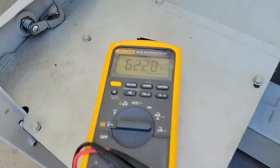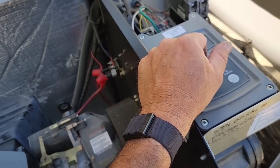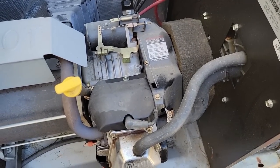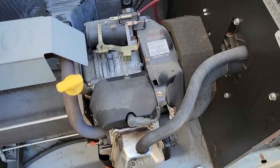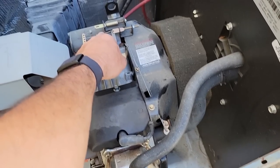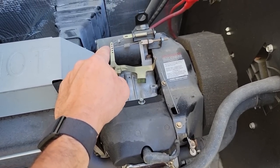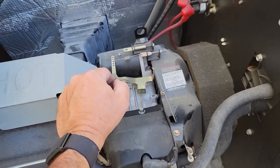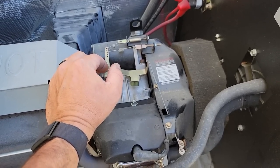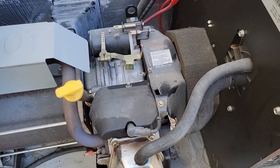Going to check frequency. This is high voltage and dangerous. Going right in at 62.4, 62.5, which is normal. The correct way to set that up is to set it under full load. Set your primary spring at half load and then full load. You've got your primary spring, which is doing most of the heavy lifting, then you have your fine tuning spring at the top. Generally it was 61.5 Hz on the bottom one and 62.5 on the top. And then as it loads up, it's going to drop the motor speed because it's going to have more of a magnetic field in there and the motor should settle out at around 60 Hz, which is generally where you want it. Even on some of the newer electronic ones, when they first went to the electronic governor, some of those would run somewhere around 58 Hz — they didn't shoot straight for 60.